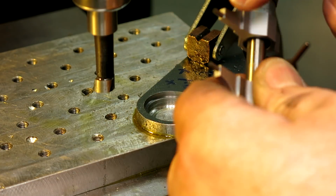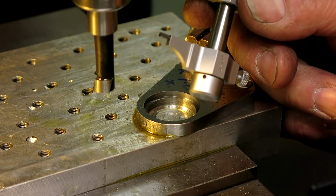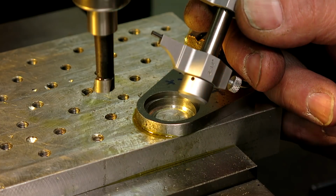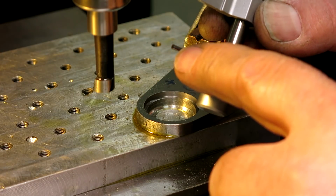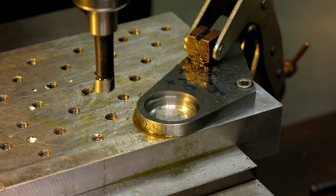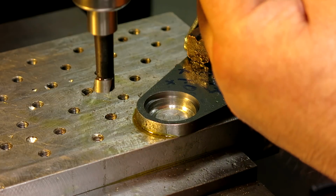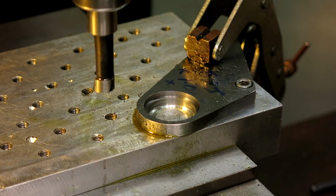These are great because they have these little short carbide pins here on this one. This is a Mitutoyo inside mic. This one's cool because it goes from 0.2 to 1.2, and it's nice because you can measure really shallow steps with this. They make larger models too that go up to approximately 3 inches, but these are a good way to measure little steps like this. What did I say? 3,000. Okay. All right, and this reads half, so that's basically 1.5 on that.